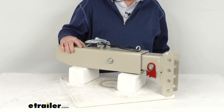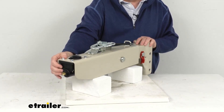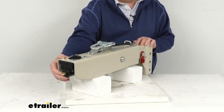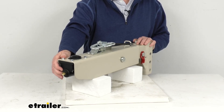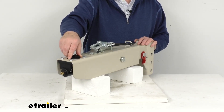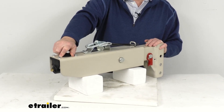It is a heavy-duty steel construction with a nice prime finish. The master cylinder in the back is a composite master cylinder, which is very durable and efficient. It is a glass-reinforced nylon construction, which will resist rust and corrosion. It offers a large reservoir to provide increased capacity for the brake fluid, and right at the top where you put your brake fluid in, they use an automotive-style diaphragm cap, which creates a completely enclosed system to help prevent contamination of your brake fluid.